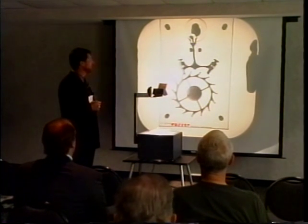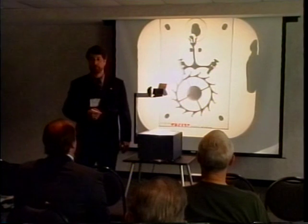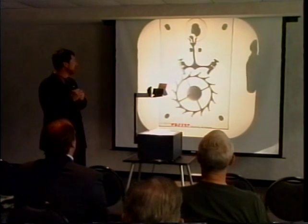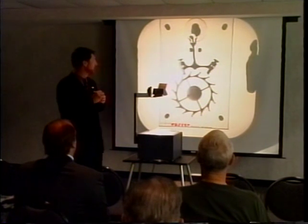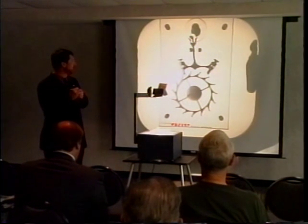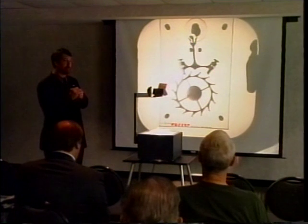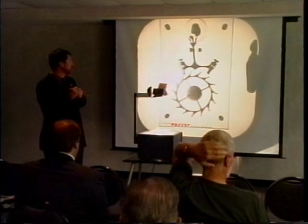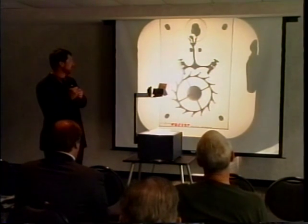The other thing we could talk about is the different types of escapement over the evolution of the lever escapement. When they first designed it, they had what they called a circular escapement, measured from the pallet arbor center to the locking corner of the entrance jewel and the pallet arbor center to the exit corner. If you were to take your compass point here, put your pencil lead here, and draw a line all the way through, it would intersect the locking corner of the entrance and the let-off corner of the exit. And then the let-off corner of the entrance to the locking corner of the exit stone.